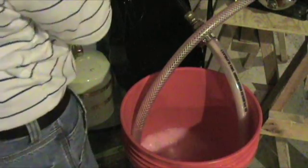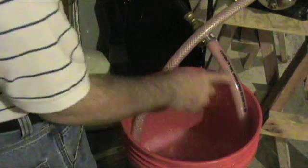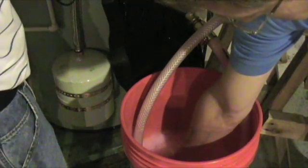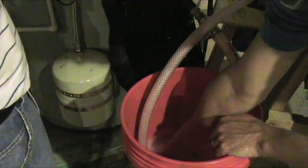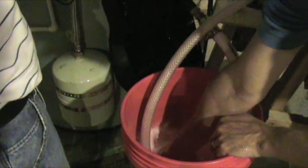With the pump turned back on, you'll see the glycol with foam in it start to transition through the bucket again, and you can actually see the color change in the return line from the collector loop. It's just a matter of repeating this procedure multiple times — generally four or five times before the system should run clear without any foaming in the bucket. One thing to ensure when running with a single bucket is that your return line from the collector loop is not directly feeding your supply line, so you don't re-inject foam back into the collector loop. Using multiple buckets can make it easier to get the foam out of solution.